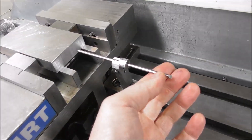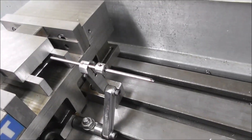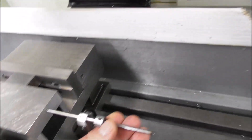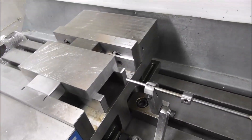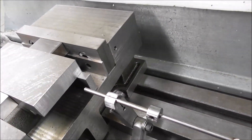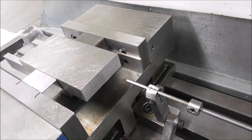If we add a retractable stop system on the side and a couple of parallels underneath, then we can just slide each part in, push in the retractable stop and remove it, tighten up your vise — I'm doing this one-handed but you get the general idea — and then remove the parallels, and then you have the work held clear of those setting gauges.